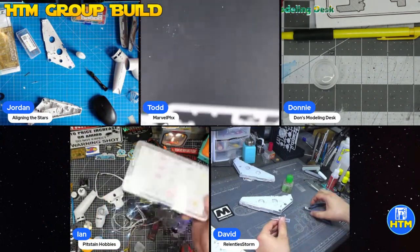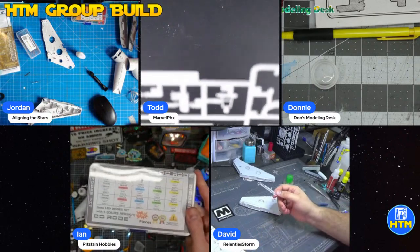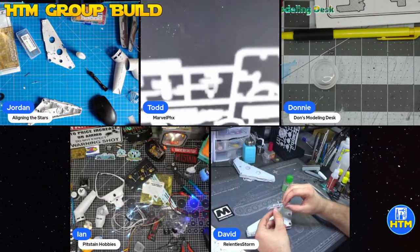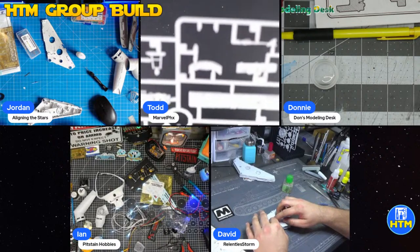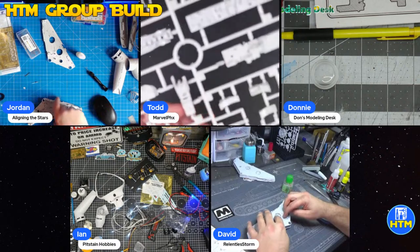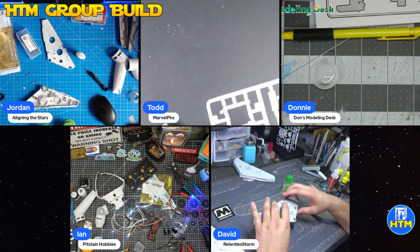Well, no, when you buy a generic box of these for like $10 on Amazon, they're all labeled. Every blue I've ever seen says 3 to 3.2, but these say 2.8 to 3. I don't know why. But the nice thing to remember is you can always put 2 volts into any LED. Even the blues and whites will light up with 2, they just won't be as fully bright as they could be.